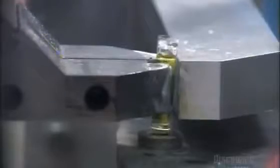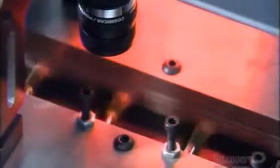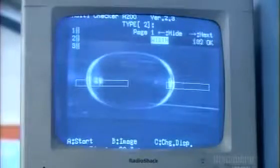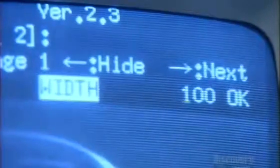The vial is then transferred to an inspection station, where a tiny camera photographs the bubble and sends the picture to a computer for verification. For this production run, the bubble should be about 1.2 centimeters wide. If it's on the mark, the computer allows the vial to move on. A printer head then hot stamps the centering marks onto the vial.